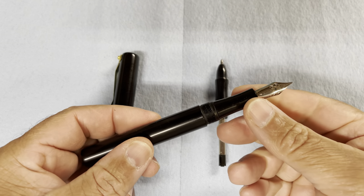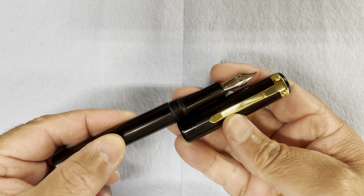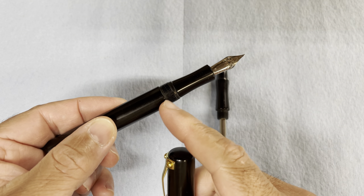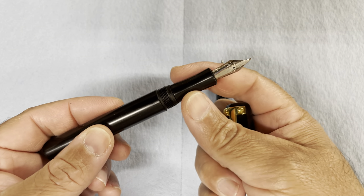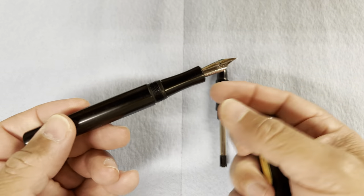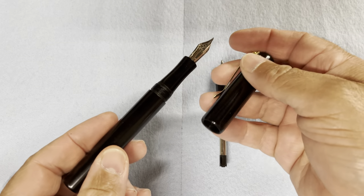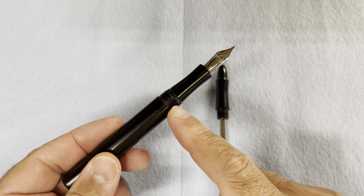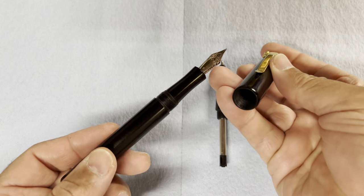Remember, if you've never done this, the bore on the inside of the cap has to be long enough to accommodate the section, the thread body, the nib, and the section has to fit inside that bore. This is the half-inch diameter — this is 33/64, just a little larger than a half inch. And this is a 14-millimeter triple-start tap and die that I use for those threads.